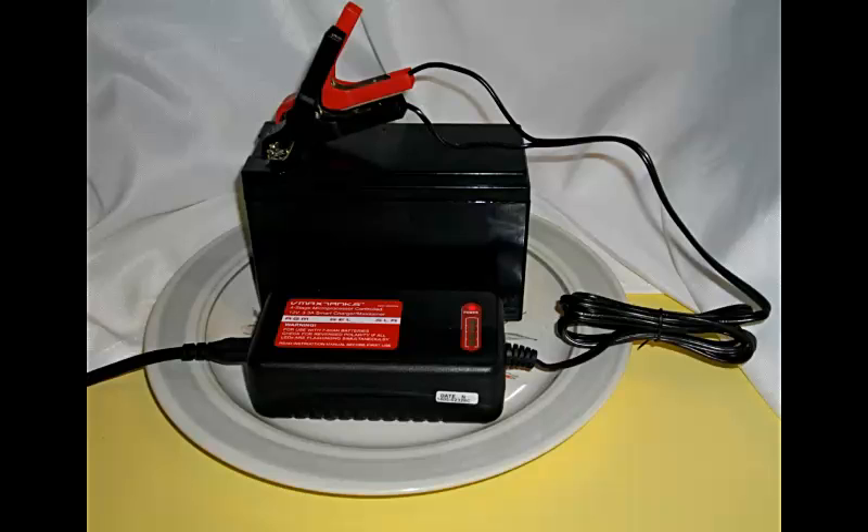First, let's talk about the 12-volt sealed lead acid batteries I've purchased. I have one 7.2 amp-hour and two 8 amp-hour batteries found on eBay. The 8 amp-hours were $16.49 each and the 7.2 amp-hour was $39.95, which included a small 8x8-inch solar panel — steer away from that, you don't really need that tiny solar panel. All three batteries are AGM sealed lead acid and are not actually gel cells. Each battery weighs approximately 4 pounds 14 ounces and is about 6 by 2.5 by 4 inches in dimension, as seen in the photograph.